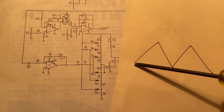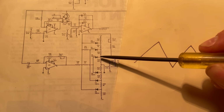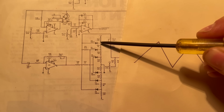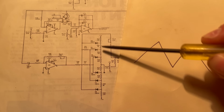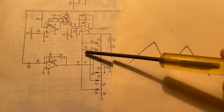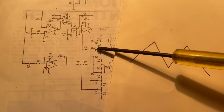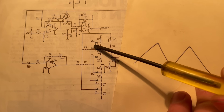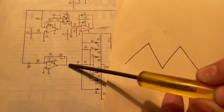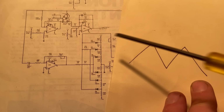Okay, so as that triangle wave rises and falls in voltage, it's going to start meeting the voltage thresholds for these diodes to start conducting, and so in conjunction with these resistors here, it's actually forming a voltage divider, another voltage divider, and you can think of that current flow away from the triangle wave coming in here as it kind of leaking away the voltage.